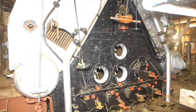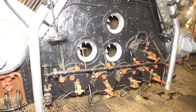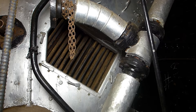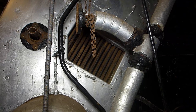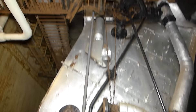This is an oil-fired small water tube boiler built by Bureau Express. In the black portion, it has a firebox where there are eight burners mounted. These burners were made by a manufacturer called Kiama. On the outside, in the silver sections, are where the boiler tubes are located. Water would circulate down through the outer banks of tubes, and then absorb the heat from the firebox passing over the first two or three rows in what were called the generating tubes. Because of the pressure and temperature differential as the heat moved across these tubes, a natural convection was set up. Steam would rise and boil up into the steam drum at the top, and then water would circulate down through the outer ones into the water drums.